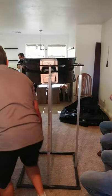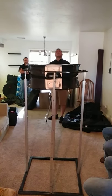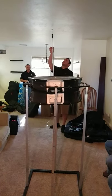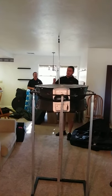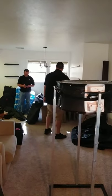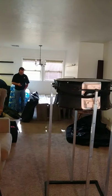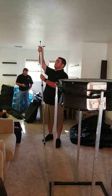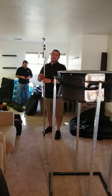I'm not sure if anybody has used duct blasters before, but these are the same poles used in the duct blocks. What you're going to want to do is preset the height of these poles — just set up the height and compress this at least halfway, then get it locked in place. That way the pole is the right length already when you're pushing it up. For a 10-foot ceiling, I had to extend this middle one a little bit before extending the bottom one.